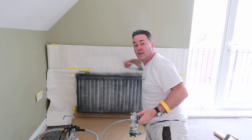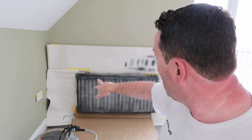I went across the top, trying to get the gun against the wall so it could spray down as far as possible at the very back, then brought it round onto the front. Because I turned down the paint flow I wasn't doubling up on coating and getting runs. I was doing a bit of triggering to blow out any dust as I went along. I'm virtually covered in all the spots I want. If there's an area your sprayer can't reach, get a brush and touch those areas in between coats — do your first coat, touch in with a brush, then finish with the spray.